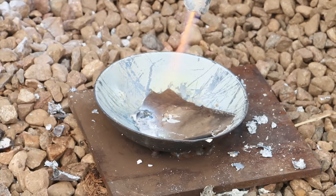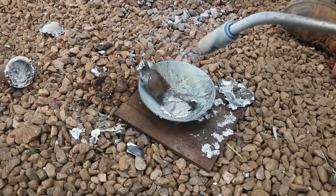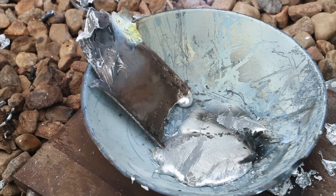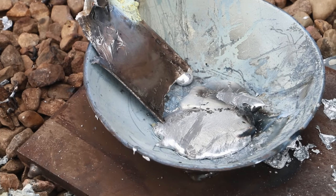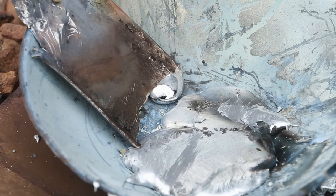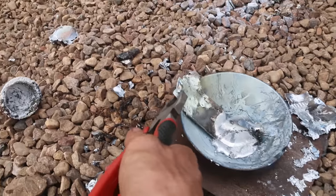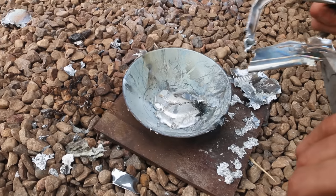We found a bit of a technique here: the chrome is so thick you can actually slide out the pot metal. Okay, that's a perfect shot. So this piece here has got the chrome on it. And Pete's just easing it up, and you can see it's melting out of the bottom. And then you don't get all that nasty zinc burning chrome garbage. Looks happy?